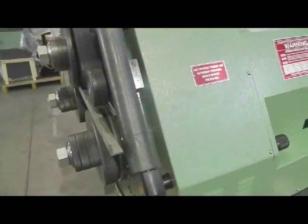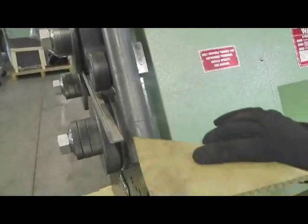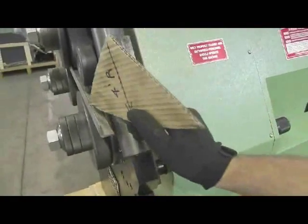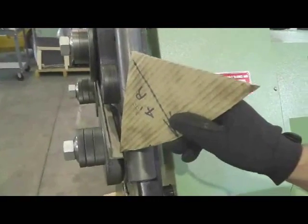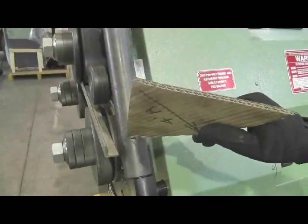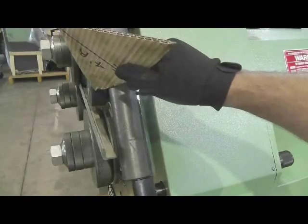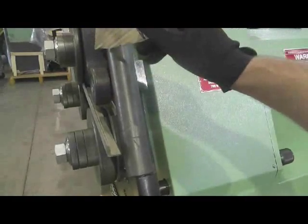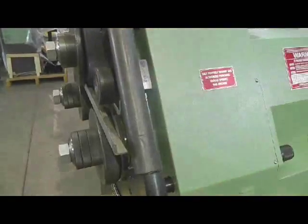Here we're looking at the left-hand exit side of this profile. I've adjusted this forming roll back. I can tell with this vertical leg here I want to catch it with this cam roller. Because this is a fairly small angle for this large machine, I've backed this lateral guide off, so I'll do most of my control just here on the cam roller itself. When I move the bending roll down, this part will kick up, and I'll then catch it with the cam roller.